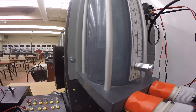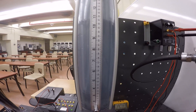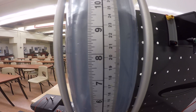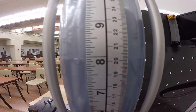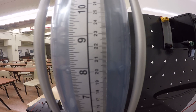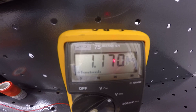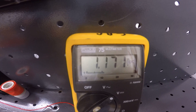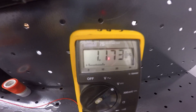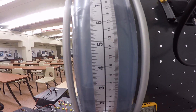Let's drop to 20 centimeters, which corresponds to 25 percent of the tank level. At 20 centimeters we should get 1.25 volts. At the bottom end of the range it's a little off — we're reading 1.17. We could keep calibrating; possibly I've got too much air going out of the bubbler at this point. That's not bad for lab purposes. Going down to the lowest level at 10 centimeters, we'll confirm we get close to zero volts.